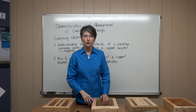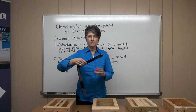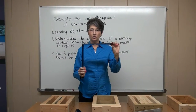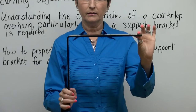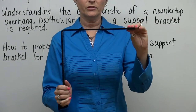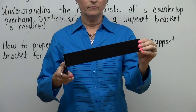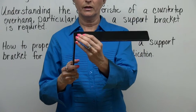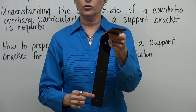As we begin, let's first take a look at a typical bracket. Commonly used in the market today is just a standard L bracket. Let's learn the proper terms for these as we get started. This is an L bracket and the top portion and the down portion both are called flanges. You have a top flange and you have a down flange. You can see that the top flange of this one is solid with no holes, so your surface is applied with an adhesive, where the down flange does have holes and it is tied into your structure.